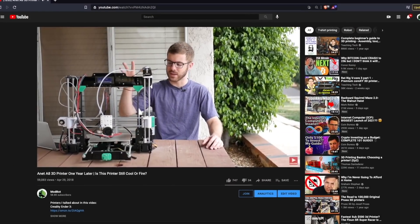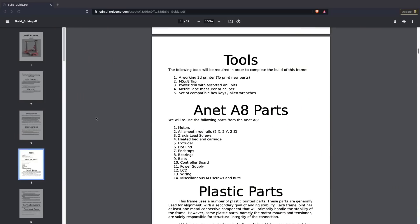If you do have the original Anet A8 with the acrylic frame, converting it to the AM8 with the aluminum frame will definitely make the machine a lot more rigid. One of my biggest issues with the original Anet A8 was that it did not stay calibrated — the frame was really easy to tweak, and without flex plates the machine would very easily skew, requiring you to redo all the leveling. Doing this mod will certainly help alleviate that pain. Looking at the AM8, the only things remaining from the original Anet A8 are the stepper motors, lead screws, and the original bed — so if your goal is just to make the machine more rigid, the aluminum frame and printed components will do that for you.